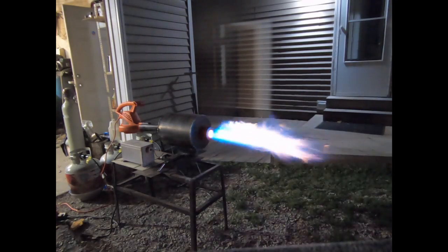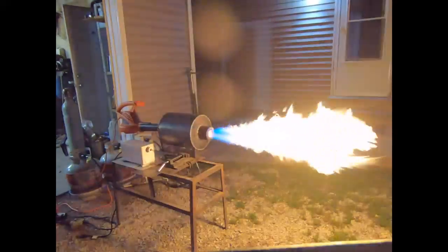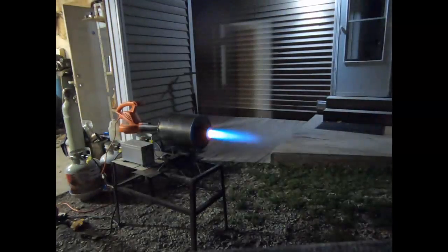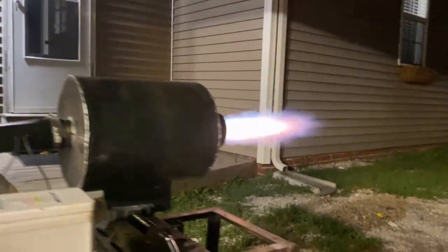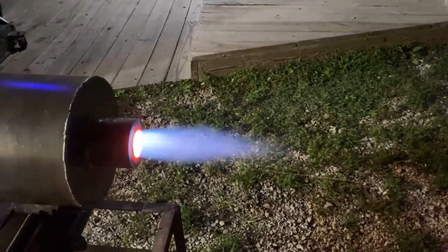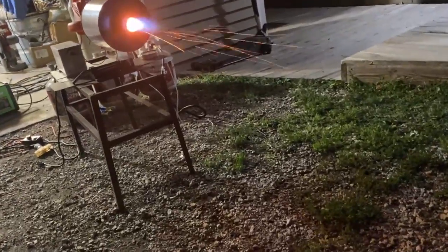What that means is on the actual burner, the spud will be twice the size of this one. In addition, to eliminate the back pressure from the blower — that half psi — we're going to configure the fuel nozzles in a venturi configuration to capitalize on Bernoulli's principle, actually causing a vacuum on that natural gas line rather than back pressure. We'll have two oil-burner-type nozzles made for natural gas inside this thing, so air from the blower passes over the nozzle at high velocity parallel to it, causing a subtle vacuum at the discharge point of the gas spud — giving us back that half psi.